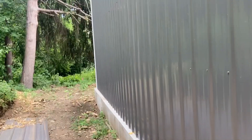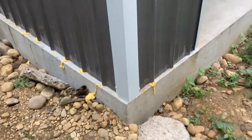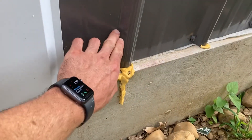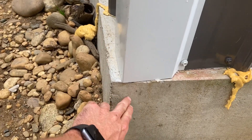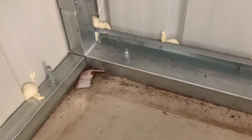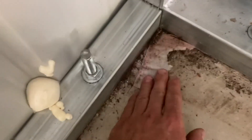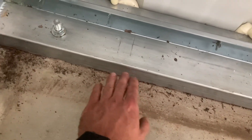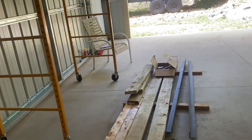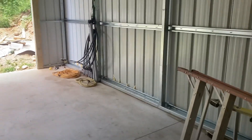With the concrete, you want to try to get it as square as possible. A lot of people will do the slab with an overhang so the sheet metal overhangs it — you often see concrete with a lip. I didn't do that because doing the work myself I wanted some buffer room to make adjustments. Since I don't have the overhang, I put foam between the concrete and the base rail to keep bugs out and hopefully help keep some water out. I think I'll probably seal the sheet metal to the slab as well.